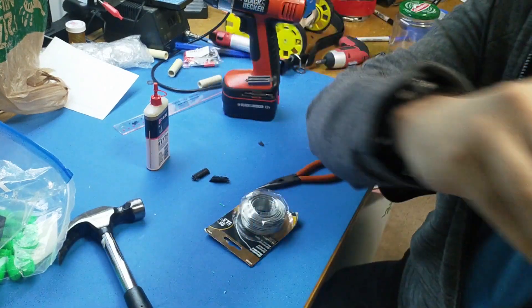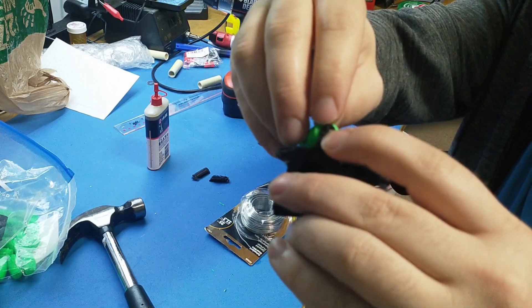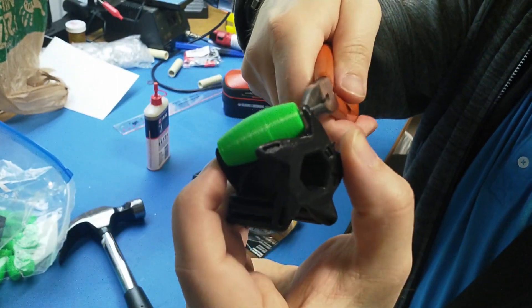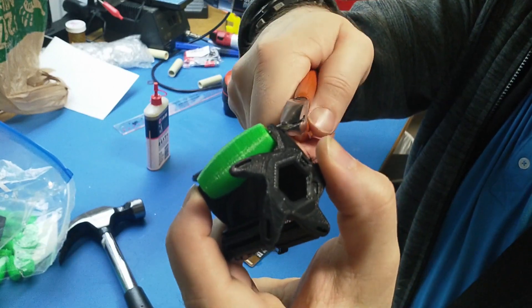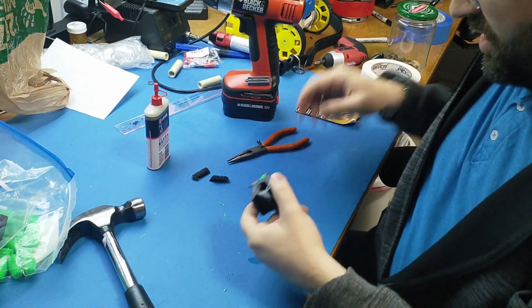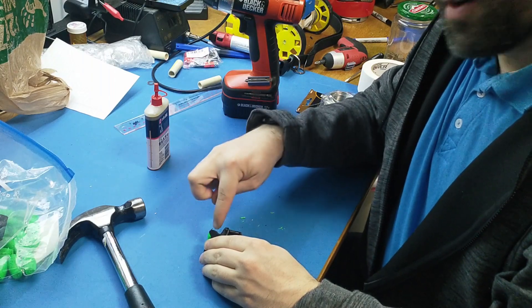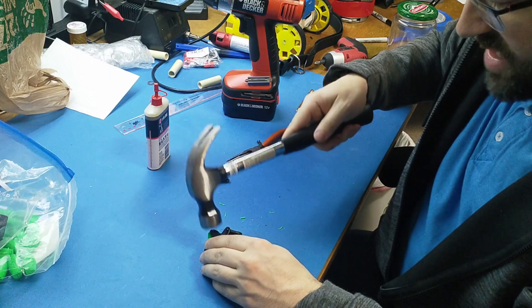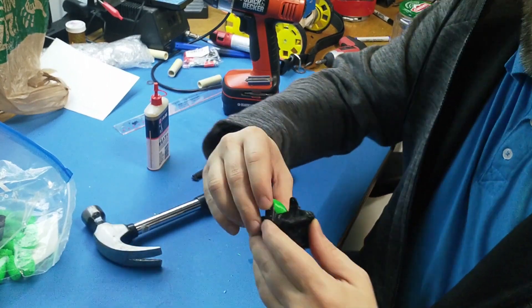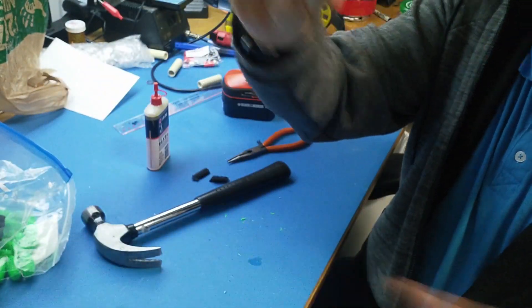We've got our roller in there. We have one bend done, one bend to go. We've cut about that much extra sticking out. I'm going to take the needle nose and put a bend in the direction of the slot it has to sit in — right flush against the base and kind of pull on the wire. It'll bend, it'll give. Now it's not sitting all the way, so like with most problems, I'm gonna hit it with a hammer. I'm going to seat this wheel so that it's sitting on the butt of the wire — that's the key thing. Take the hammer and just give it some little tippy taps. You can be a little aggressive. Now that wire is seated on this side and seated on this side — we're rolling. Do this four more times and you've got yourself a wheel. That's all.